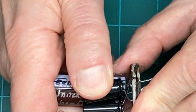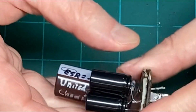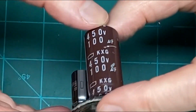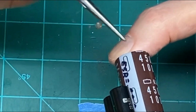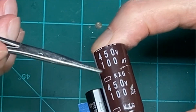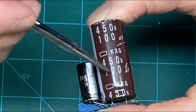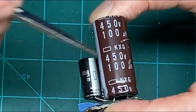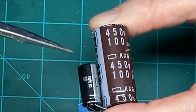And I think we'll do it that way. And while I'm at it, I was going to tell you about the capacitors. I'm using the large 80 microfarad one here, which actually is 100 now. The original was an 80 for the radio, but this is all I had. And it's okay to go a little higher on rating when you're working with filter capacitors.